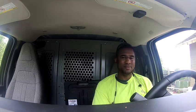And you ask, how do I handle them? Say if this dude wouldn't have had an attitude, I could have hooked up a thermostat going straight to the board inside the unit, and maybe manually opened the dampers so they could have cooling for the night. But with the attitude this dude was giving me, I'm not even gonna suggest that. I told him the warranty company is probably not going to approve this, and you may have to pay out of pocket for this zoning board.